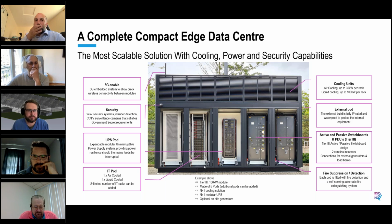And just one comment, I wasn't sure whether I was clear from an Uptime Institute tiering perspective. We can design to any of the tiers 1 through 4. To give you an idea, we've just done a 0.5 megawatt design for Africa. It's all DX, sub 1.35 PUE, and they're getting a tier 4 design for less than the cost of a traditional tier 3 facility.